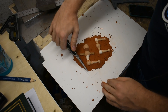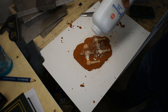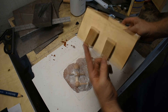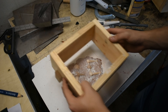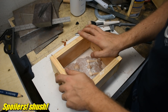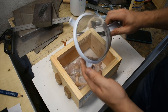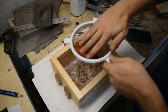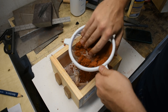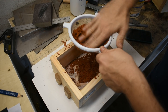I'm going to trim the edges just a wee bit. And from here we pull out the parting powder. If you remember, these used to stick out a little more — well that board is now a bookshelf so I don't have it anymore, so I cut them off. Now from this point you ram it up like normal. And guess who got a sifter that I totally didn't steal from the kitchen when my wife wasn't looking? What this does is it only lets little bits of sand through, so instead of just getting a bunch of big ugly clumps, I get a bunch of powder on top.